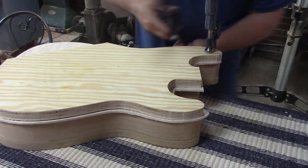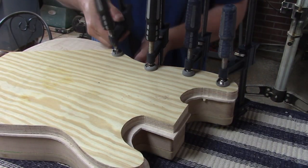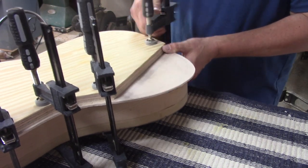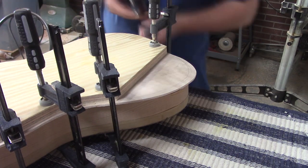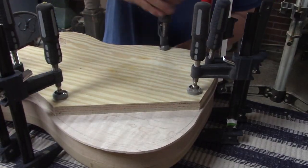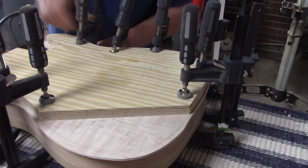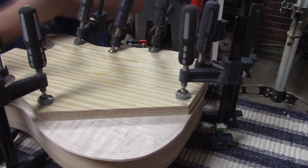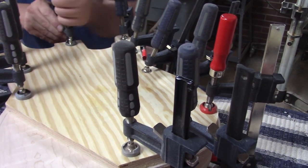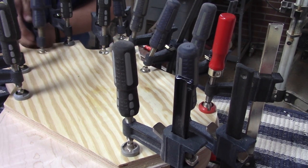We're not worried about the clamps marring the finish because we're on clamping cauls on the top and the bottom. The nice thing about having a solid clamping caul on the top and the bottom is we're distributing the pressure of these clamps evenly across the whole instrument. That should yield a really tight seam — and even if you are going to bind this, you want to have a good seam, because that's just quality work. Sometimes, I'm not going to lie, you can cover up some errors with binding — I'm not suggesting any great big company has ever done that, but maybe they have. Alright, this is getting crazy clamp action everywhere and it looks really good — there's a nice amount of squeeze out all the way around.